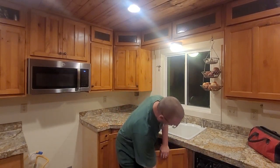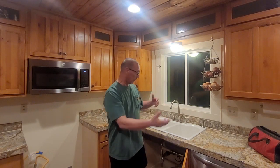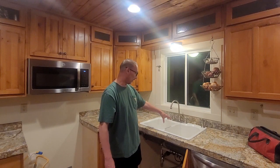Okay. Well, it's evening. Dishes have been cleaned and the dishwasher has been emptied. The last thing I got to do tonight is disconnect the sink and take the Sinkerator, the garbage disposal, out. That way when they come, they can rip the counters out and rip the sink out. We're gonna get a new sink, new faucet, and it'll be an undermount solid granite single bowl sink, and the drain will be on the right side, so that won't be in the center.